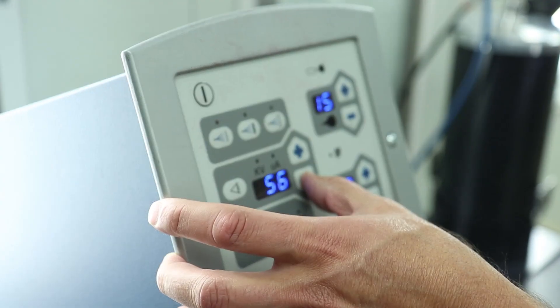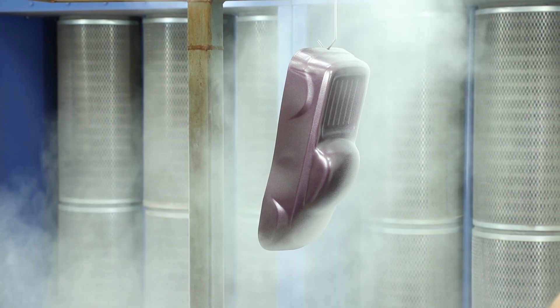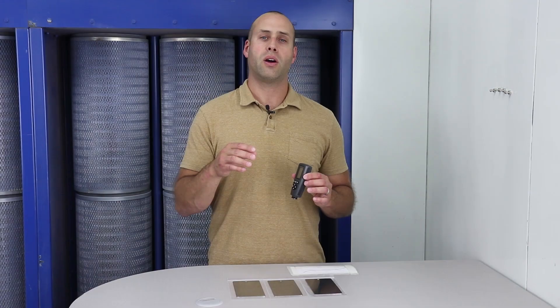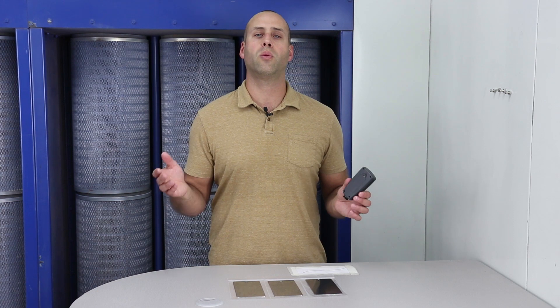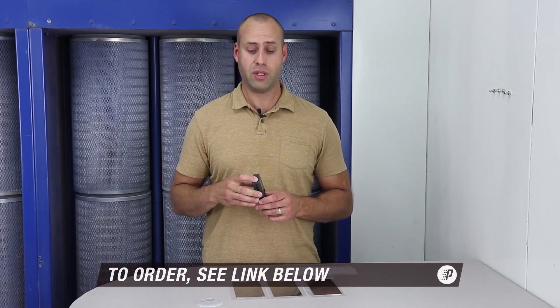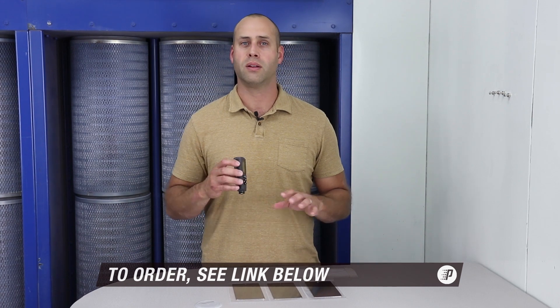It also really helps develop your technique. When you're spraying, you've got a combination of things going on — gun settings, the number of passes that you make, and your hand speed. All those things combined are going to determine what the mil thickness is. If you don't know your mil thickness, there's no way to know how to alter your technique to get the best finish. These are pretty decent units — the ones I use pretty much every day — and they make a really great option.